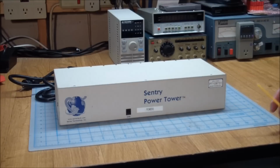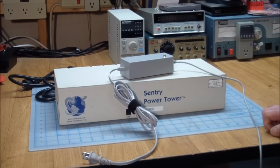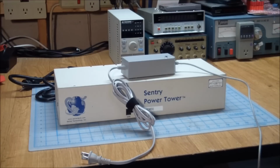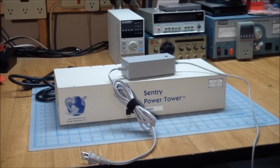So I got up in the morning and I'm working on a piece of hardware I'm designing that I worked on pretty late last night, and thought it would be a good thing to plug it in the morning. It's a board, powered off a donor from a Nintendo Wii, which makes a damn good 12 volt DC supply at 3.3 amps. So I plug this thing in, the board powers up, my computer UPS emits a weak beep and proceeds to cut power to the computer.